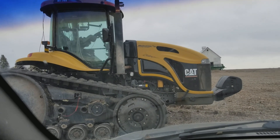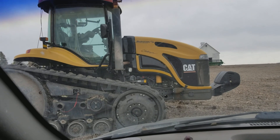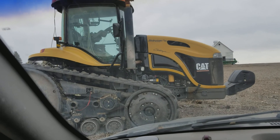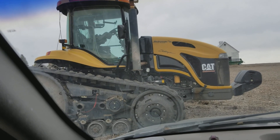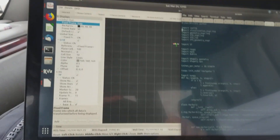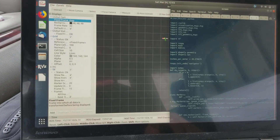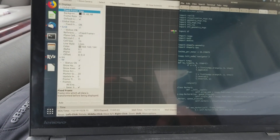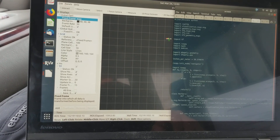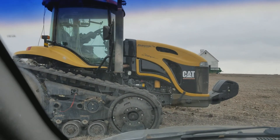Last night I was thinking about how to do navigation better. I had a little problem because my waypoints were at zero altitude or map altitude, and my tractor is at 600 some feet. I thought of a solution overnight and came back to test it, but I found out my INS is not working — the dual antenna feature is not working — but it seems to do alright without it. So I'm going to start this and see what happens.